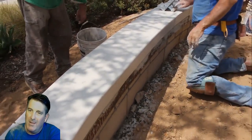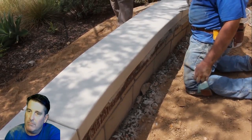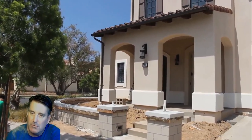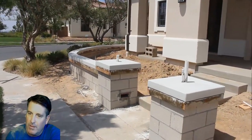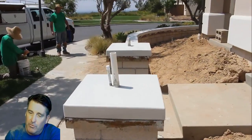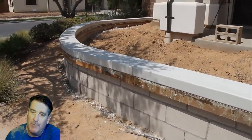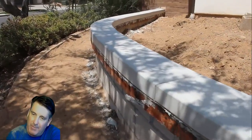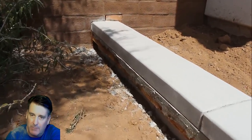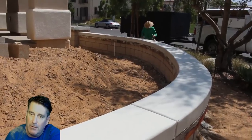There's your troweling technique — I have a trowel that's just about the right size for this cap width, and wide enough so if you turn it sideways you can catch the whole side with one stroke. That's what it looks like when it's all said and done — nice and smooth. Those two-by-fours underneath are going to come off, but you can't take them off the same day — it's risky. Leave them on for a couple of days; the further you're cantilevering out, the longer you've got to leave them on before the concrete is strong enough to support itself. I took them off the next morning and it held well.